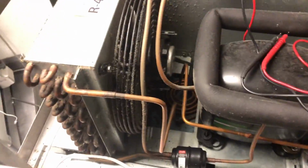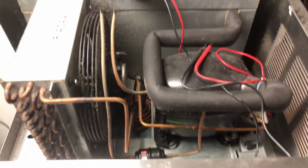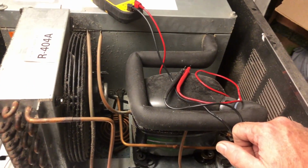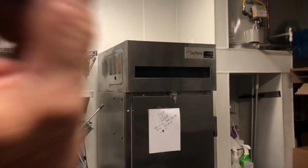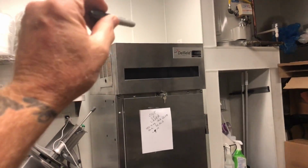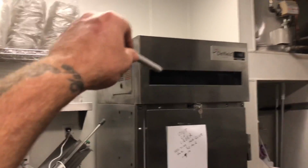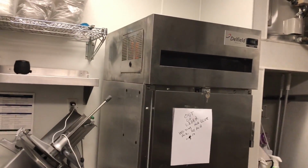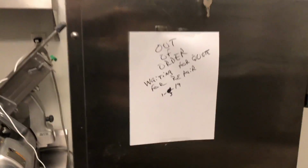That's all I can do on this one. I'm all zoomed in. Let me zoom back out. That's gonna be what we're gonna do on this one. This one's hammered. And that's how we roll. This one's so hammered. I gotta quote a compressor. I gotta redo the condensate discharge loop, filter dryer, deep clean the condenser, replace the temperature control and the 2 probes, and it's gonna look like this